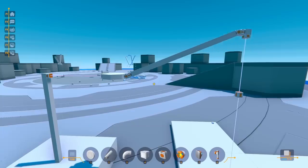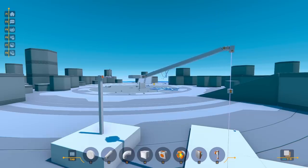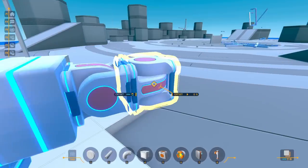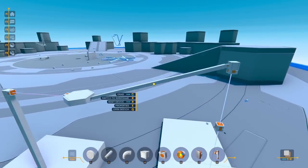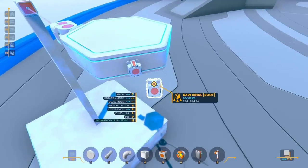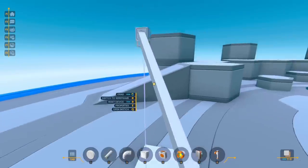This is pretty much the movement I'm looking for, but once I add in the other arms, they're not going to be directly across from the first arm, so they need to be able to bend slightly side to side. After staring at this long enough, I thought one of the problems was that these hinges were stacked directly on each other. What I ended up doing is offsetting them directly into each other, so both hinges take up a single block of space. This functions exactly the same way as I move the arm up and down, but once I add on those other arms, it should start to function correctly. To simulate that movement, I put the frontal extender at a slight angle to the first arm, meaning it needs to bend slightly as it pushes in the printhead.